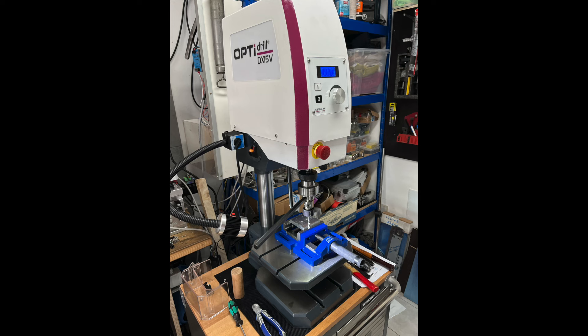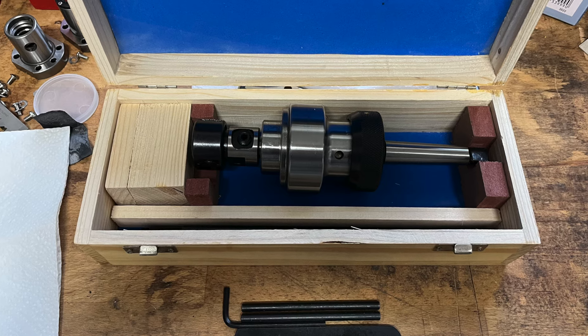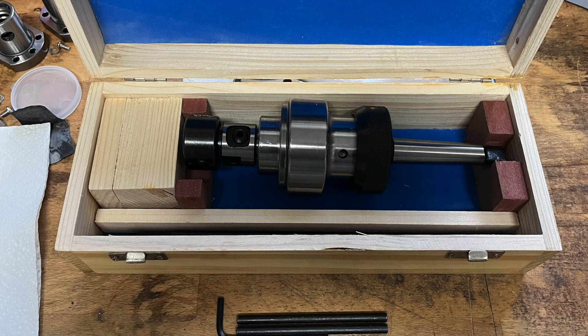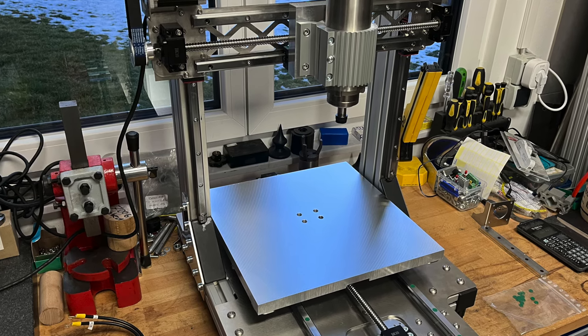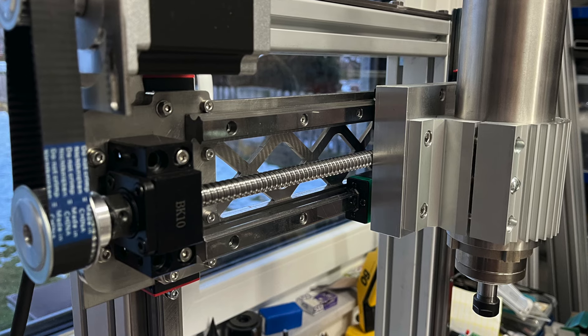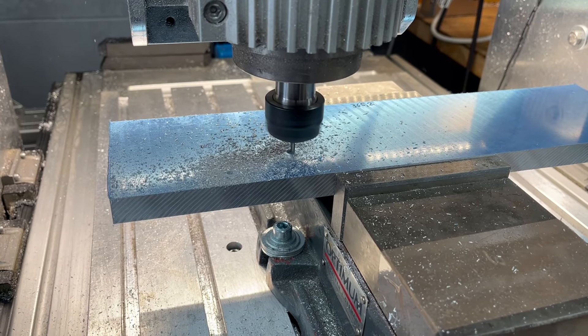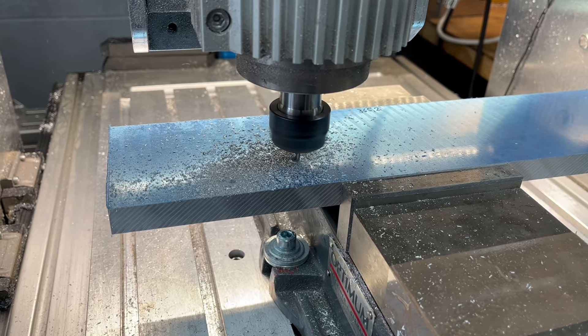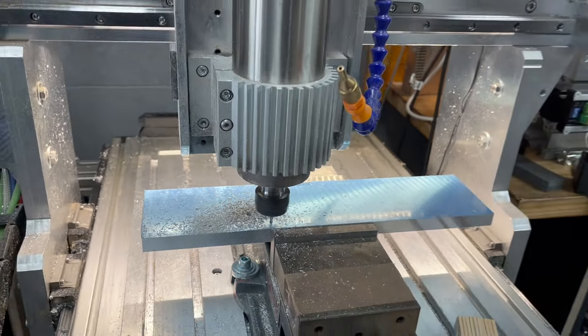Yes, I think I've now said everything about the OptiDrill. As I said, I am really satisfied with it. Also this thread-cutting adapter is really top for the price. Why did I actually buy all this? Well, because for my new project — my Patreons can already see it — it is the CNC conversion mini-milling machine. I had the problem with the portal bridge that I needed to cut very many M5 threads for the linear rails. At some point that became too much to cut by hand, and to make things easier for myself — since I want to eventually offer the whole thing as a kit — I bought myself a proper bench drill press.